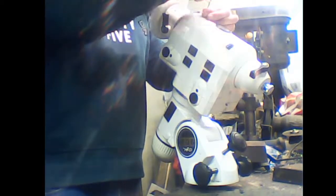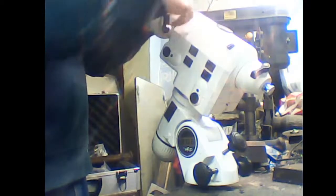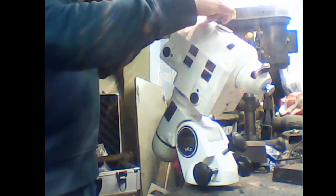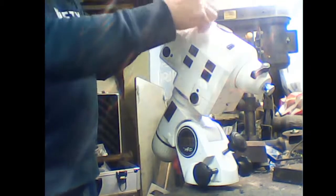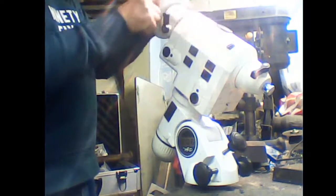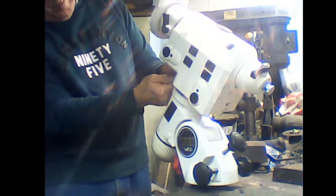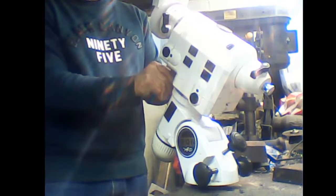removes backlash by pulling the worm into the gear. You just rock that, you can see it rocking. I just start tightening that up. What this actually does, just pull the casting forward. And bingo, it's gone. Back it off a little bit. We tighten the back one up. It will loosen. These work to sort of push-pull